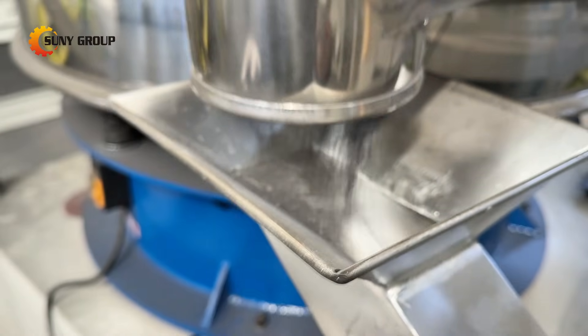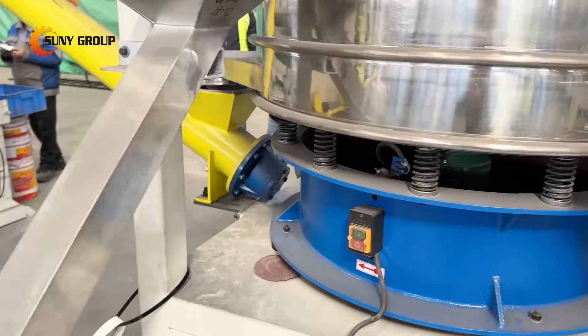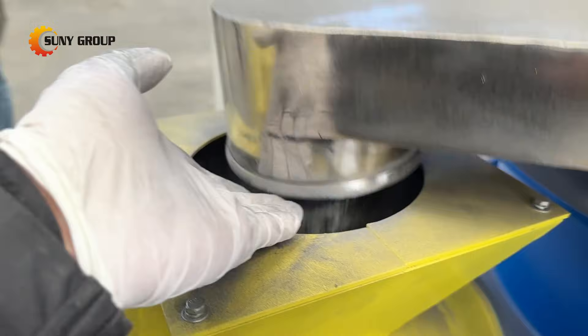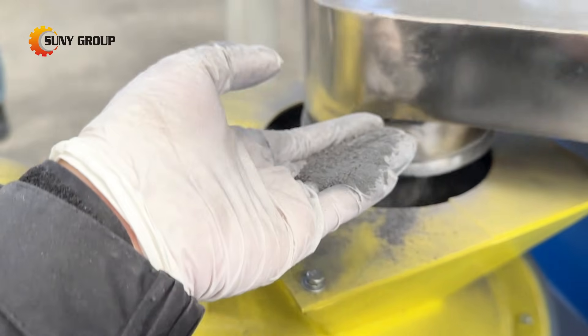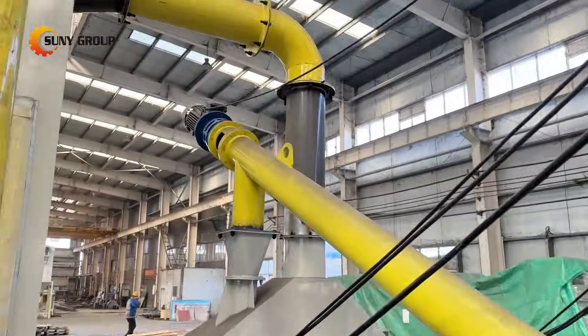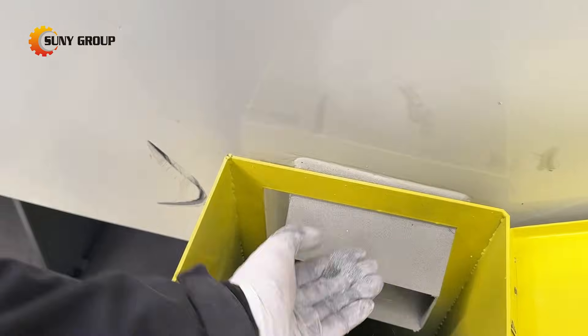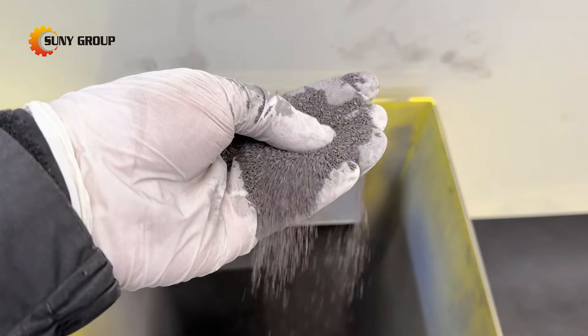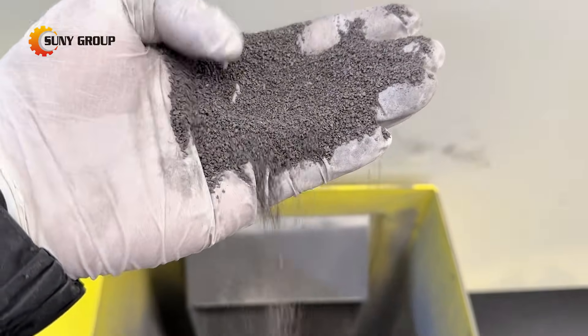For fine processing, the material goes through a knife crusher, then into a grinding mill, transforming mixed PV residues into controlled-size powder. This powder then enters the airflow selector, which separates light plastics from heavier mixtures. Based on customer needs, this project excludes electrostatic separation, but the line still offers a complete recovery route. Glass, metals, and silicon-rich powders can all be efficiently collected through cyclones and other collection units.